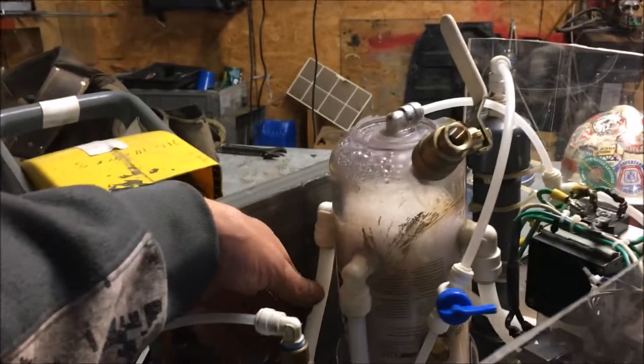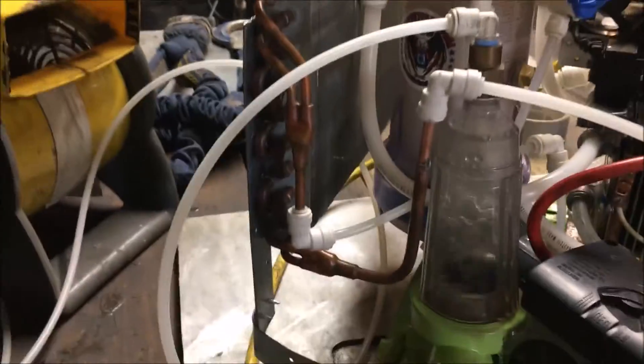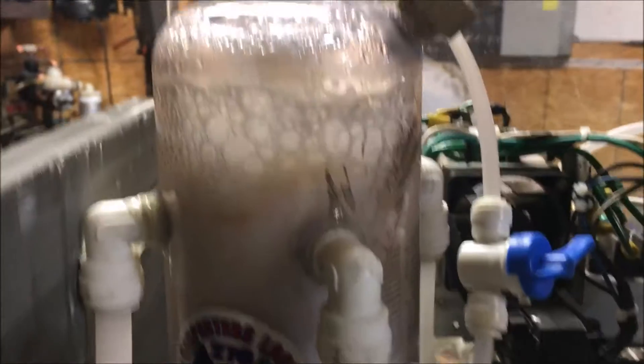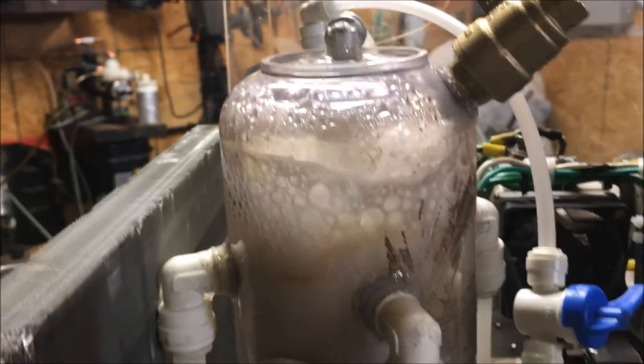This thing is pretty much going to heat my garage at this point. I can feel a lot of heat coming off of it, which is good. So yeah, that's what I'm doing here right now — I just want to flush all the filth out of this radiator, because I only flushed it with acetone briefly. Oh yeah, I'm foaming up fellas. Even with potassium hydroxide I'm foaming here.